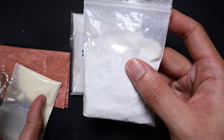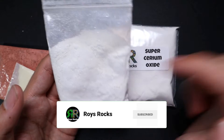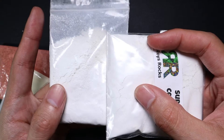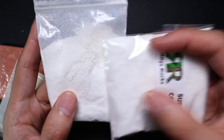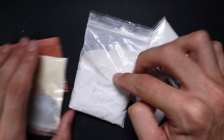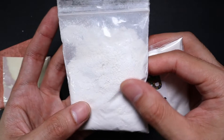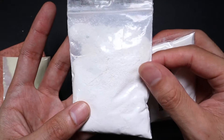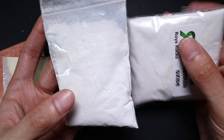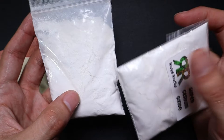Then we've got this one here. This is a polishing powder produced by the black lighters, and it's still a cerium oxide — slightly more impurities, a little bit more yellow, but far less yellow than the optical-grade one. It has had a few more things removed, still got a little in there, and it works pretty well. I was using this for quite a long time, but the price was a little bit high for my liking.